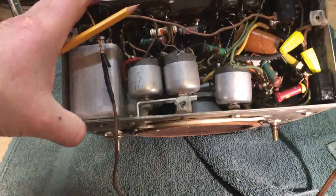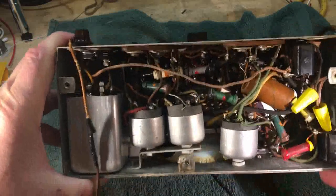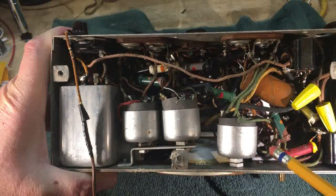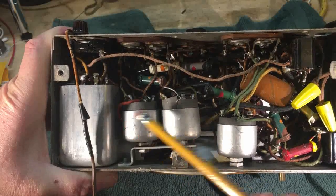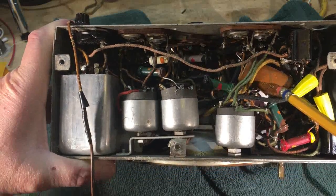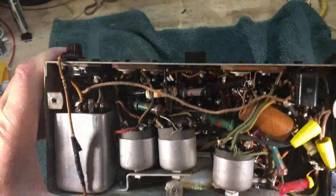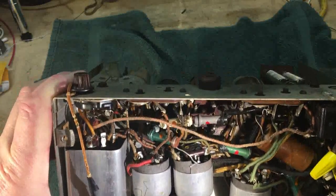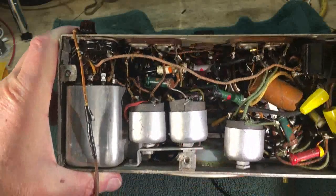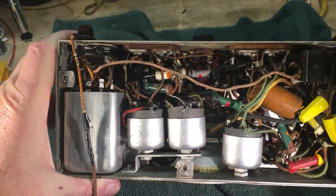It's pretty compact under here. The IFs are a little strange — these appear to be just tuning capacitors on the back of the chassis, with shielded coils mounted separately, which is a little different. Here's a capacitor that's been there since who knows when. The filter capacitors are over here — I'm trying to see if they've been bypassed or replaced, but they look original. Other than the power cord, I'm not sure; someone might have put that one in at some point — it doesn't look original.